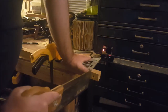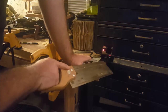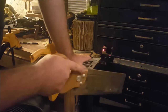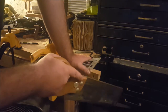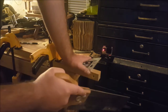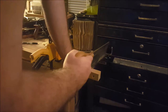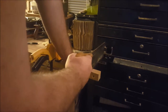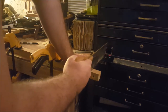This will give you a straight cut down for a little ways. Another good thing to do has to do with ergonomics and biomechanics — you have a natural inclination to aim where you're pointing. It works in handguns, works in archery, works with handsaws. It's just something about the human anatomy. So you draw your cut back a couple of times to get it established.